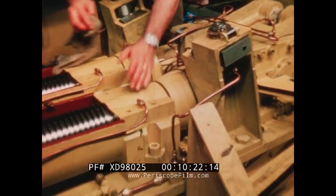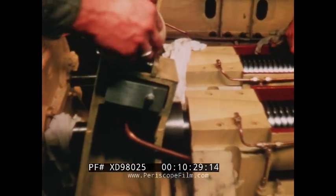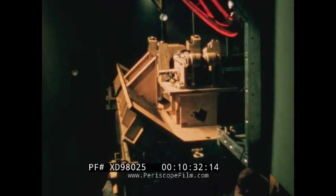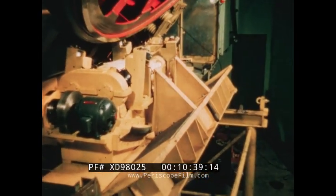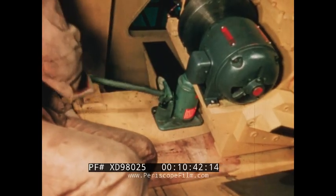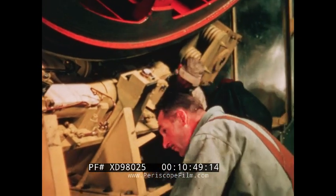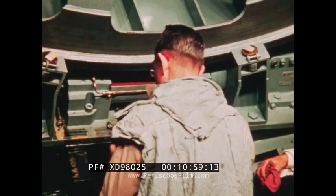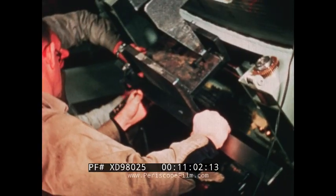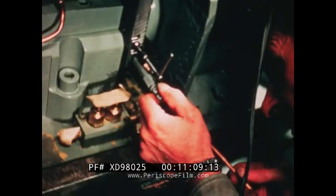One of the most unusual terms associated with this instrument was the right ascension cradle. This intricate piece of machinery, manufactured by Oakland Machine Works, contained the worm gearing which, when positioned properly, would motivate or drive the large right ascension gear. These scenes show the cradle being moved into position directly under the gear. The alignment of the worm gearing and cradle relative to the main gear was a long, tedious job which taxed the patience and engineering ability of all concerned. After many months of adjustment, they were ready to operate the entire gear system.